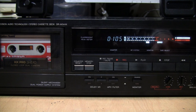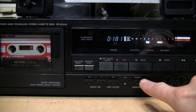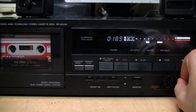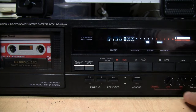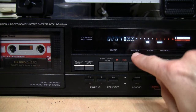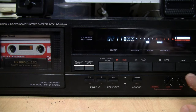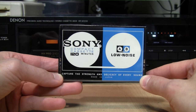I switch over to tape, start recording, and adjust the level until it matches 0 dB — we just had to turn it up a little bit. Then I switch to a 10 kHz tone at -15 dB on the input level and select tape to hear how it's being recorded. This tape needed slightly increased level and slightly reduced bias to be properly calibrated — a little bit more negative bias to make it stable — and now it's properly calibrated.